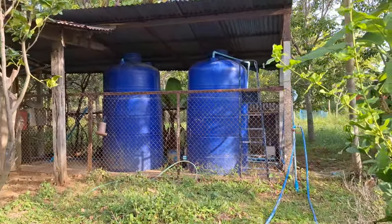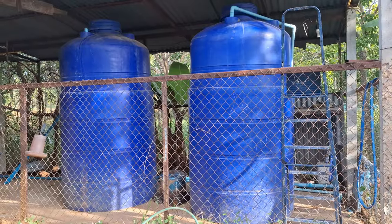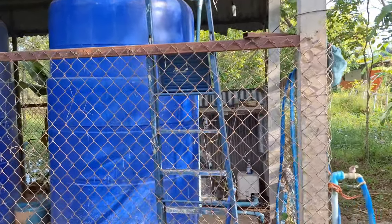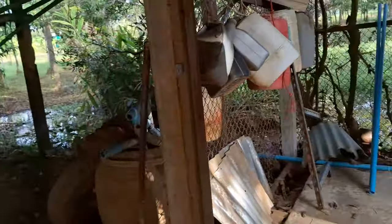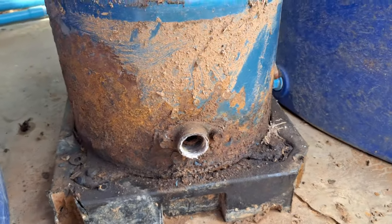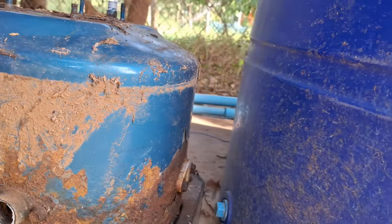This is the tank and pump room — you can hear the pumps going at the moment. There are two 2,000-litre tanks above ground. Here is the old offending tank, which sadly doesn't last extremely long. Maybe through four years you tend to get corrosion. There are some things that aggravate that, and as you can see there's a lot of corrosion on this one all the way around the base.